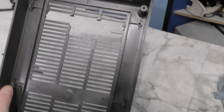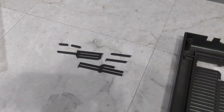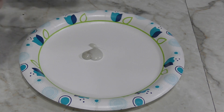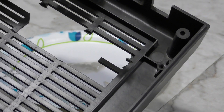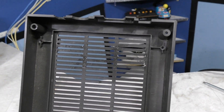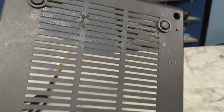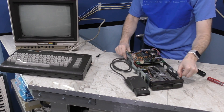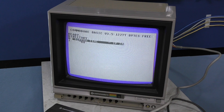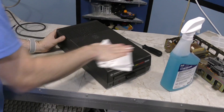I want to do something about this broken plastic, and here are all the pieces I found inside the disk drive. I thought about superglue but decided to use epoxy instead. The main reason being it would be really difficult to get everything in place in the time superglue gives before it cures - this stuff gives me about 15 minutes, though in my experience it's more like 5 minutes to work with. Still, better than superglue. It was too difficult to film while working on it, so here's how it came out. The epoxy is still a little wet, but this is going to look a lot better than a giant hole. There are a lot of what-ifs with this project, so I wanted to test it before reassembling everything. The good news is it does work, so I will reassemble the drive and give it a good cleaning.